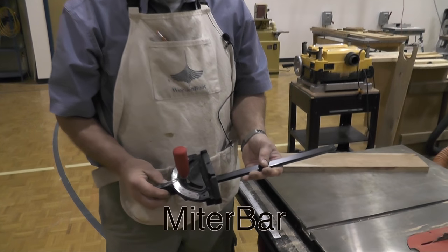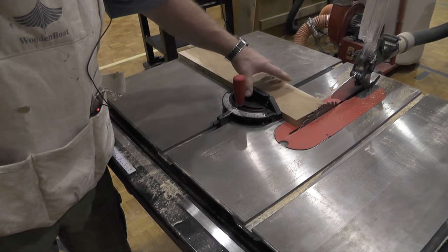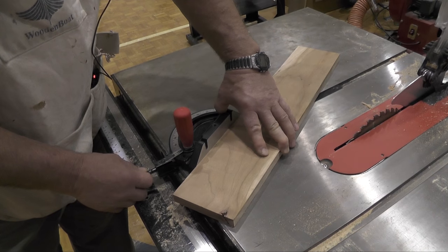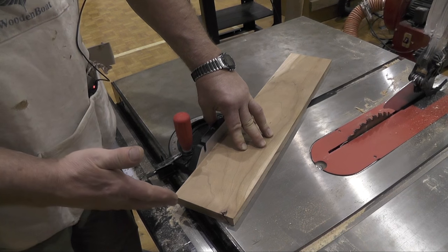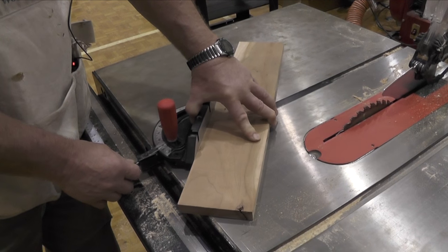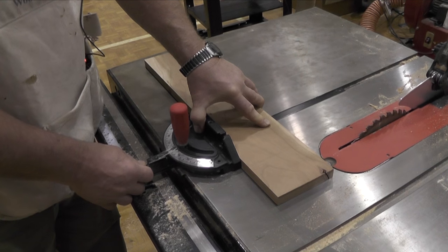This tool is called the miter bar — some call it a miter head. A miter is simply an angled cut, going against the grain. If it's a 90-degree cut, that would be called a cross cut. If I loosen it here and twist it, I can get as much as a 60-degree angle cut. I can also do this on the chop saw, so I have my students do these kinds of cuts on the other tool. I can do 45-degree cuts, 30, 25 — anything I want.